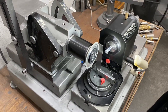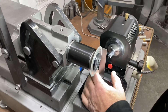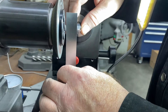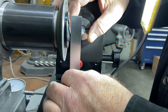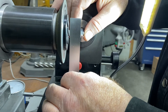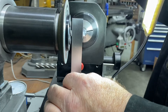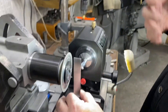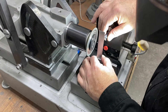What we want to do in this video is get around all the processes quickly so you can see what's going on. Something we've ignored in the past but are no longer ignoring is the timing of the tool. If you don't time the tool to the machine, don't expect your flutes to be parallel to the machine axis. Plus, timing the tool allows us to go back in and pick up the grind, so if you don't like the end, you can just re-grind it. It's really easy to set.